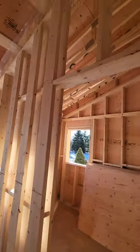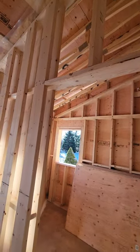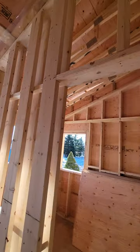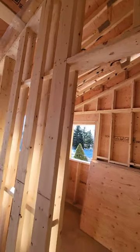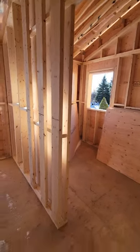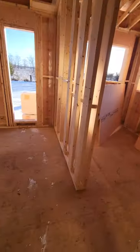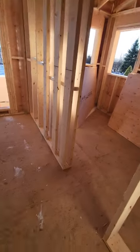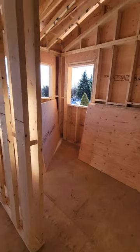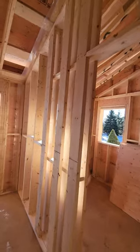The main thing is to screw a block in there to keep the studs from twisting until the drywall goes on. Make sure you give yourself enough clearance — 84 inches is good, and you can always build it down later, but it's better to have it a little extra high. Some homeowners don't know what flooring they'll put down — three-quarter inch flooring, laminate, or vinyl strip — so give yourself enough room. It's okay to have a little extra space at the bottom for airflow. Until next time, happy framing!